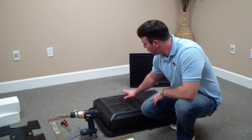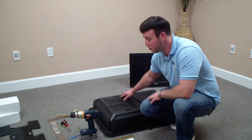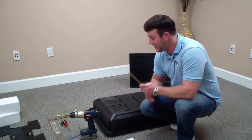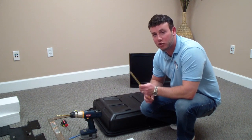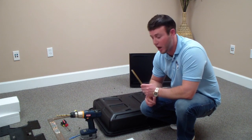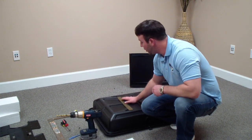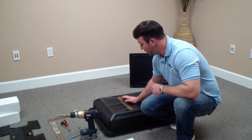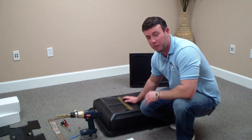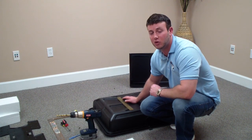So again, when making your first hole, measure twice and drill once. Make sure you are measuring to exact points, and do it two or even three times before you drill that second hole, because you most likely won't have a second shot. You're going to want to make sure you're drilling by the millimeters. If you have something to measure millimeters, use that. If not and you're converting from inches, make sure you're as close as you can possibly get.